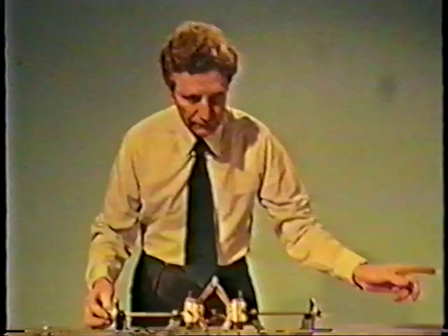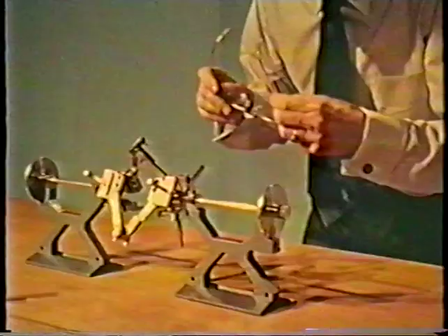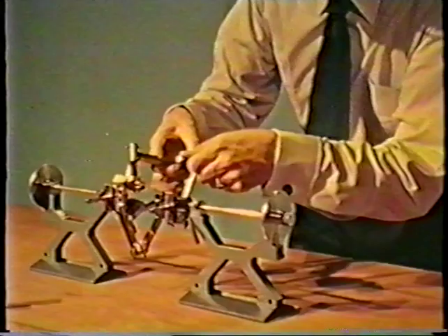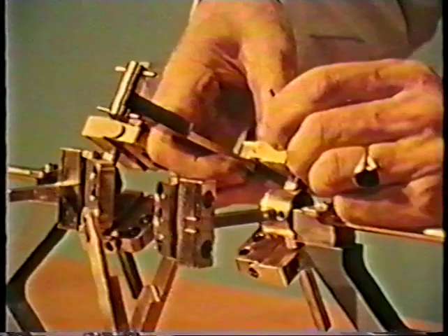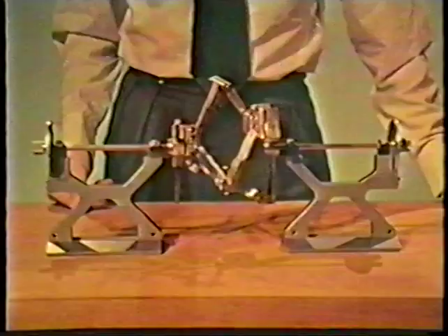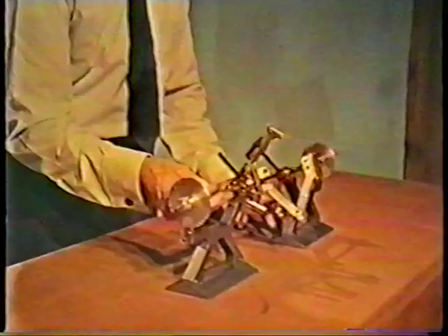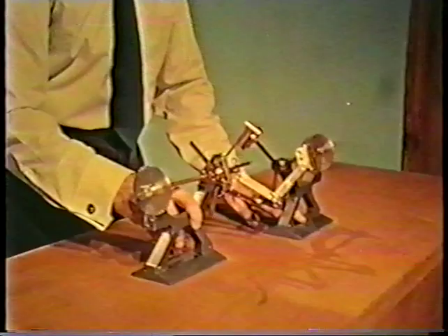For the coupling to work properly, we must resolve this dilemma. And we can resolve it, if we want a parallel shaft coupling, simply by removing any local symmetry and at the same time unambiguously establishing an imagined plane of symmetry at infinity. This we can do by altering the settings of the mounting blocks, so that each connecting chain is tipped over. When all three connecting chains are reset, no local symmetry remains. And give or take a little looseness in the joints, the shafts cannot angle with respect to one another, but they are free to shift parallel with one another, and at all times they're constrained to remain parallel.